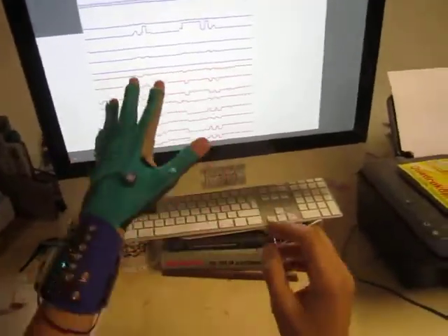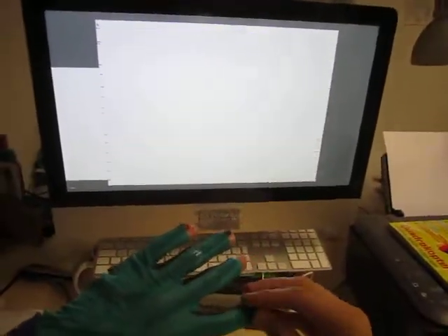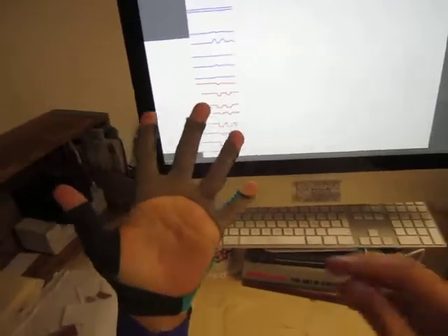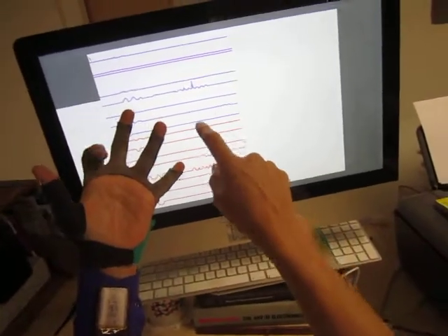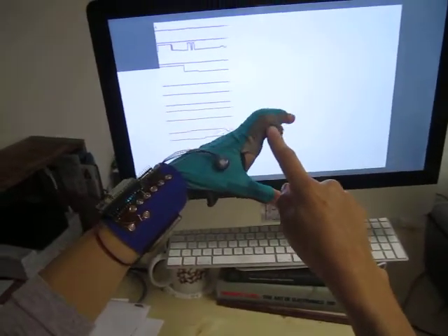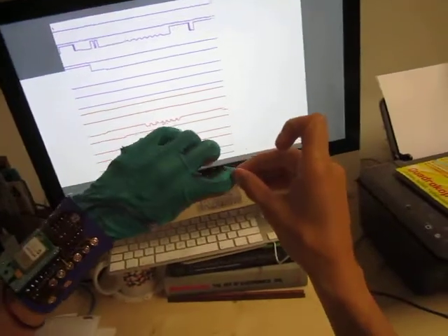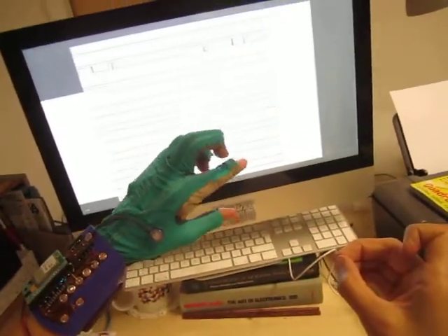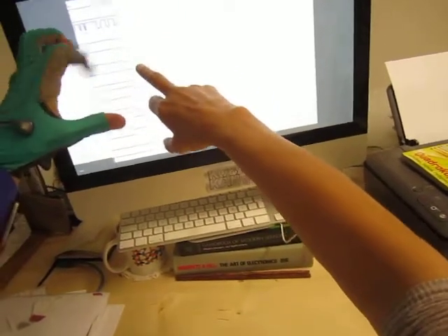The flex sensors seem to be working as well as they were in previous gloves. With the e-textile sensors, the values aren't changing as much. They're working quite well on the finger knuckles, especially the middle finger knuckle and the ring finger knuckle. The index finger knuckle is shorted out right now because I was trying to make a fabric button that is so tight it is pressured all the way. But now you can see the bend of the index finger knuckle, and if I push on top, I can trigger the push button, which should normally recover itself — so this shorts out the sensor and triggers a button press, while this bends the sensor.